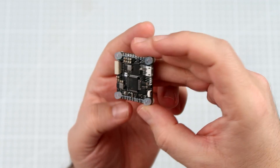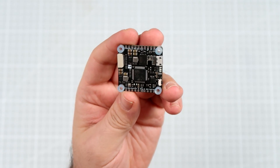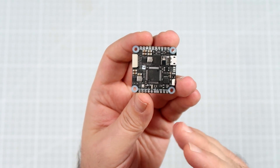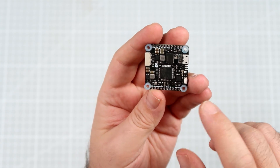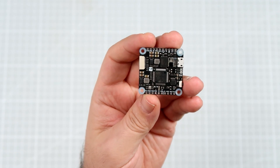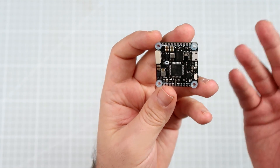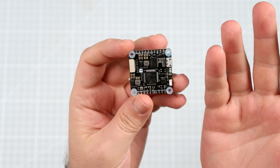On this side you might notice there is no SD card slot. This is pretty unusual for Matek — they usually either have an SD card slot or no blackbox capabilities at all. This board has a Winbond flash chip that can hold up to 32MB of blackbox logs, which is really plenty. I'm not the biggest fan of flash blackbox logs, but that's just me.